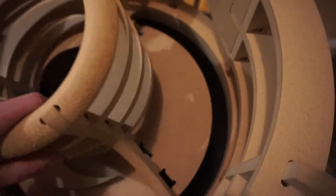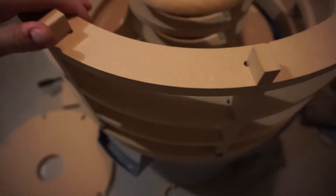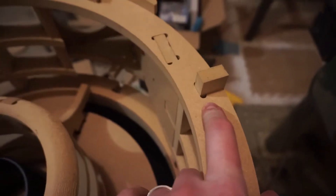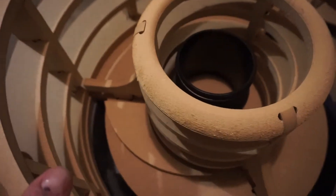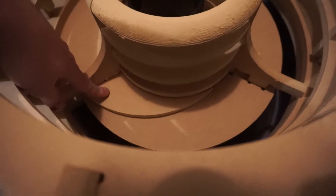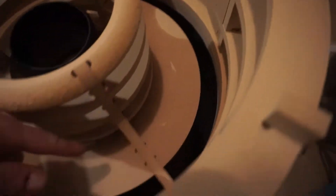This isn't actually installed yet - none of this is glued together, it's all just friction fitted. With the CNC it's able to be extremely tight fitting, so there are reliefs in every corner so that the end mill can knock out a square edge for the part to fit into. So far everything's fitted together pretty much perfectly - I haven't had to modify anything. In these corners we're going to have these little angled bits, there are three of them. When the air is swirling around, it's going to direct some of the dirt which might have collected in here back into the slot.